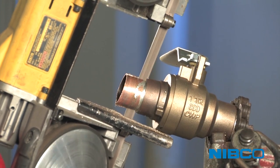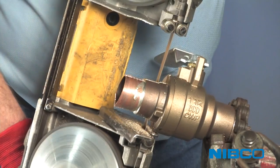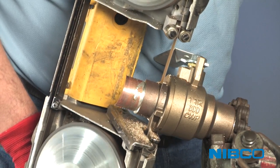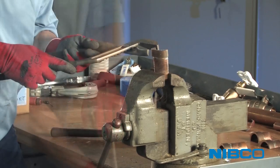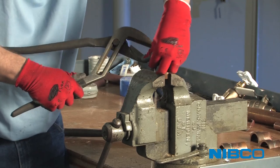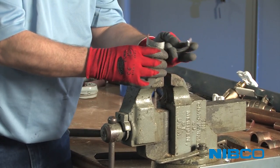How is the quality of a solder joint judged? Solder joints are best evaluated by cutting and peeling back to reveal solder coverage. Cut the joint with a saw and peel the tube from the joint. Less than 100% solder coverage is not uncommon for both lead-free copper alloys and alloys containing lead. In general, solder coverage of 70% or more is often cited as the benchmark of a good solder joint.